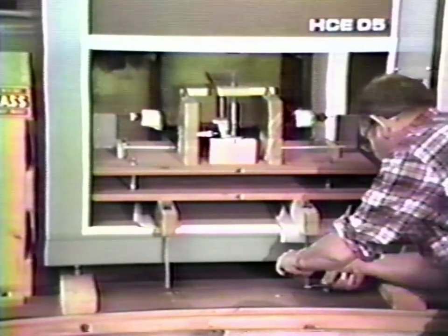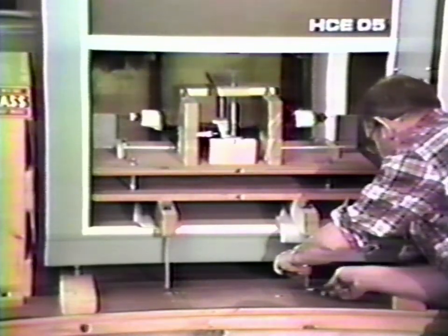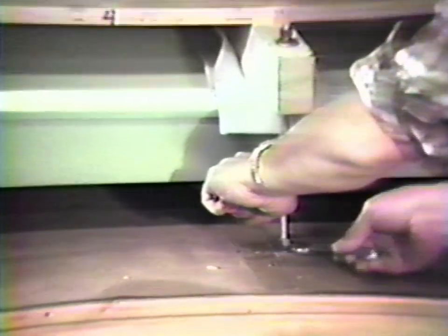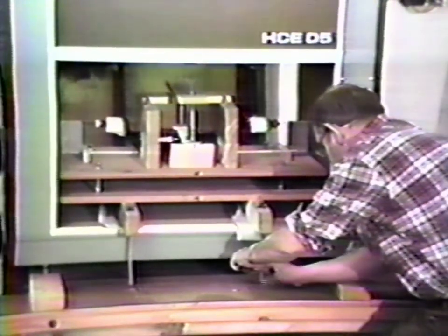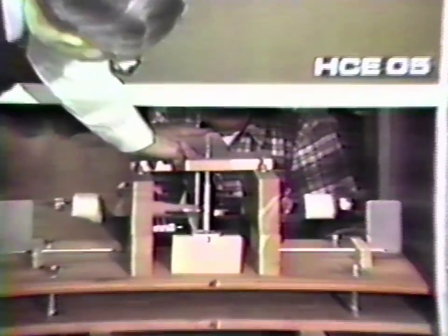Remove the beam cradle by removing the nuts which lock the threaded rods onto the base. This must be done on both the front and back of the skid. Before removing the cradle, note that the pointer at the end of the beam must not be damaged in removing, so just be careful in removing this entire cradle.